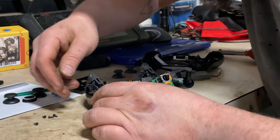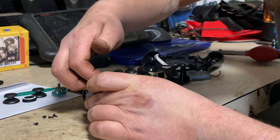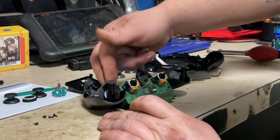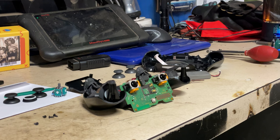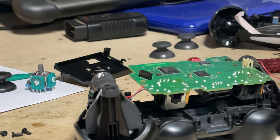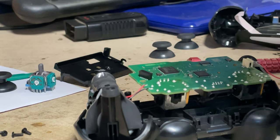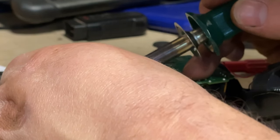We want to take off these little rumblers so we can work with the board more easily. They're kind of a pain — if you don't like rumble on your sticks you can just cut the wires and you'll be good to go. Otherwise, let's get down to the soldering process. I'm going to desolder the old rumblers off the board. It only takes a second, and to re-solder only takes a second too — you just press the wire in and re-liquify the solder. The red one is on the top side of the board.